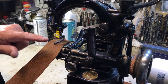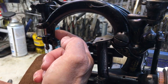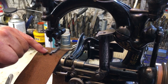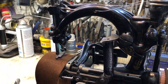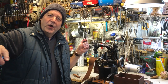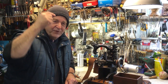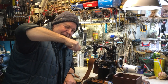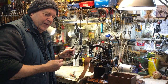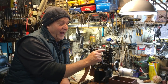Let me show you normal stitching first — this is just normal chain stitch. Now I'm going to pull the alternating foot back and you'll see the foot lift up. The foot is lifting up because when straw boaters were first made you had a long straw plaiting, and you just turned the first little button right on the top doing really really tight turns. They found that if they lifted the foot, operators could manipulate this tight turn — often it was damp when they did it.